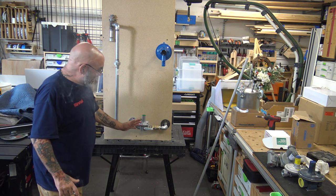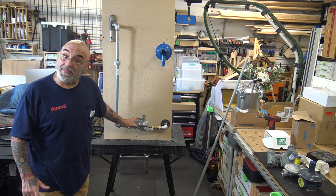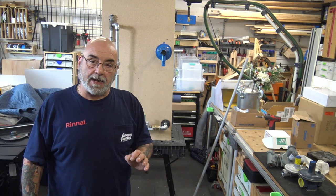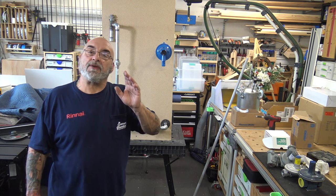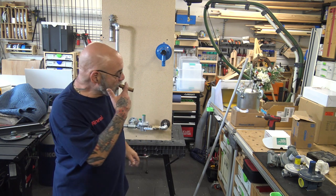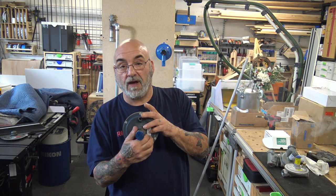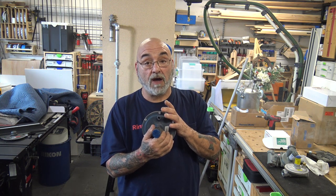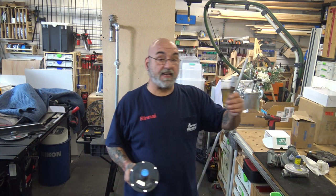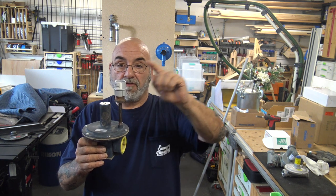So, in this case, with this regulator, the Pietro, the vent head here, or the weather head, is adequate for venting. Now, venting a regulator, the code is that you have to be at least 5 foot from a source of ignition. So, on every regulator, you have some type of vent. Now, on this regulator, there would be a vent limiter on it. But this is 1/8 of an inch. So you would need something like this to adapt to this and then run the vent out.